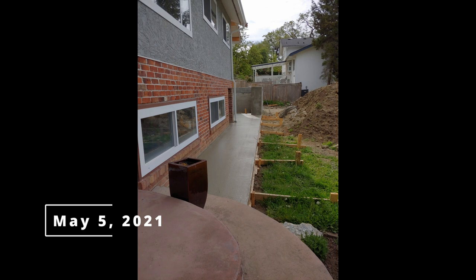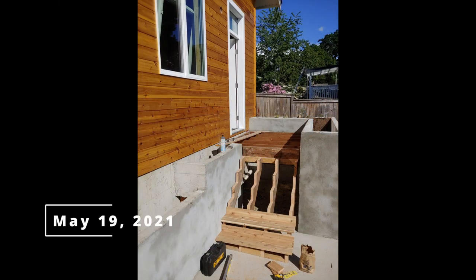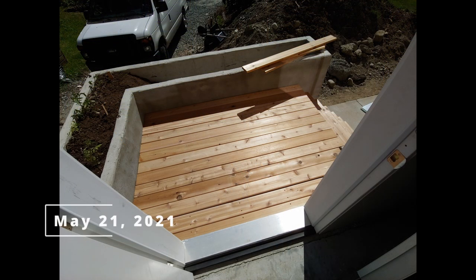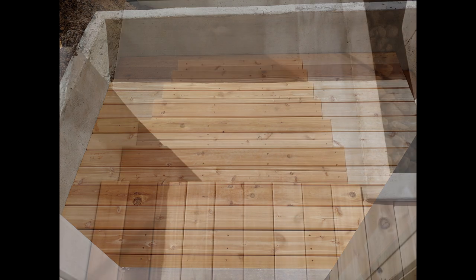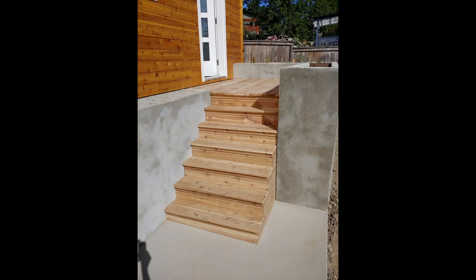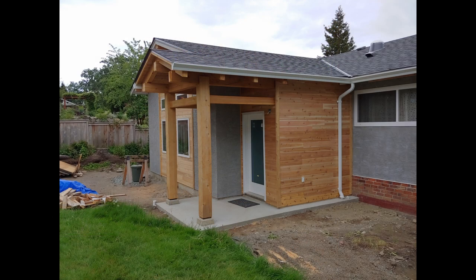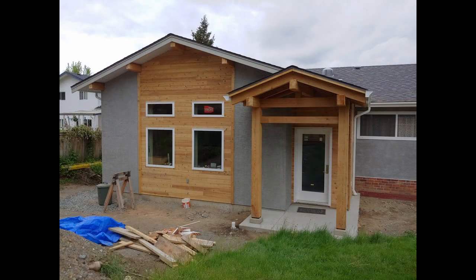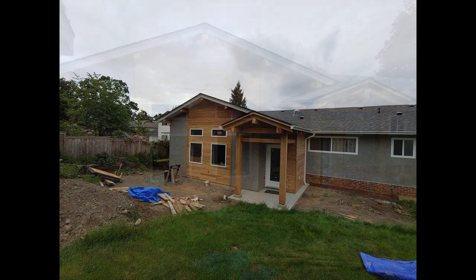Our contractors had poured a front walkway, and as soon as that was cured I got to work building some front steps and a front deck. This took a couple of days of work with cedar, and once I was done I thought it looked great — but I found the rise of the stairs was a little too steep for my liking. Although it looked fantastic, I had to take them apart, modify them with new stringers, and make them a bit deeper. I also did the cedar around the back door now that the pad back there was done and got that stained up.